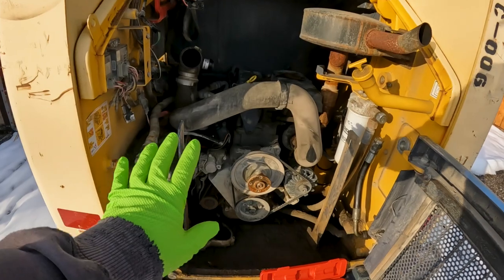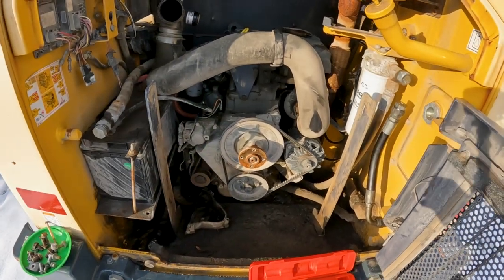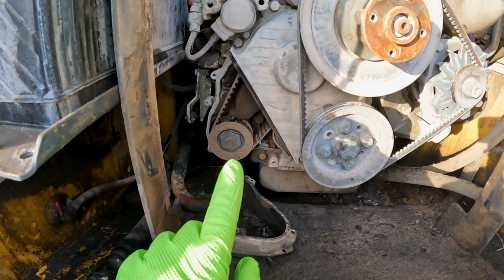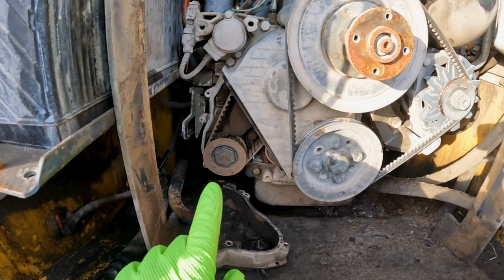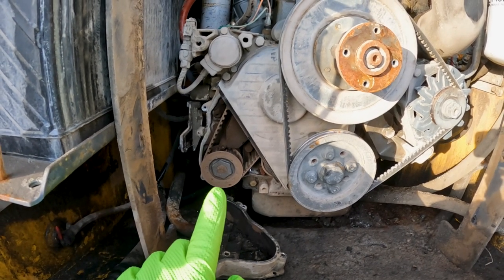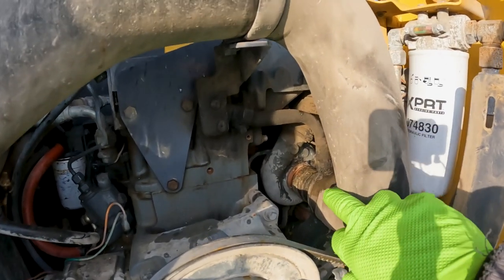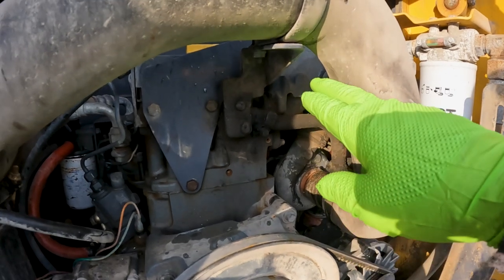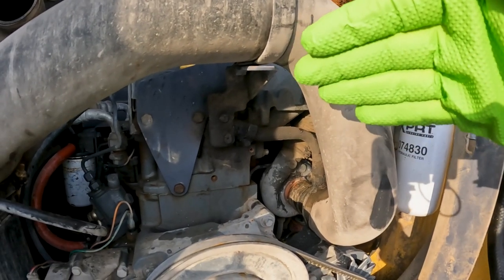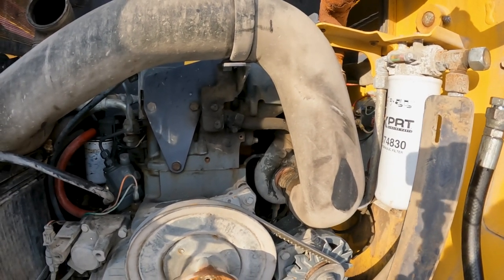Right in this area on the Gehl is where the cooling package would be. Since this is an oil-cooled engine, I had to pull the whole entire oil cooler out and the fan assembly off to get down to this corner. I wanted to inspect the timing belt because if these get out of time just a little bit, they will smoke really bad. I pulled the cover off, the timing belt looks really good and tight, and with the timing pins in, it's perfectly in time. I also pulled the intake boot off the turbo, opened up the intake manifold, and checked inside for oil - because if the turbo goes bad, oil will get inside the engine and cause smoking. But the turbo is good and there's no oil inside the intake, so the smoke must be coming from somewhere else.